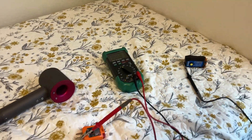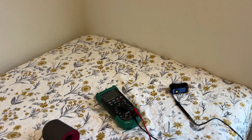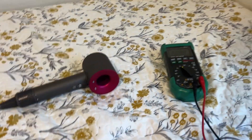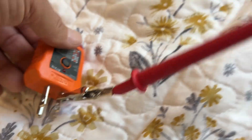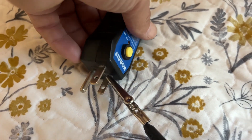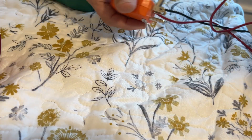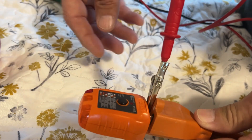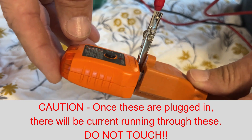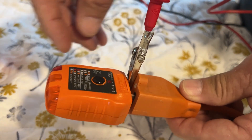Let me show you my setup. We're going to measure the voltage drop on the neutral wire. As I've experimented with this, I've found it very difficult to hold the probes steady inside the receptacle or inside the end of an extension cord. So I've bought some alligator clips and clipped them onto the neutral blade. You don't have to use alligator clips — you can use the probe tip directly — but the alligator clips definitely made this easier.